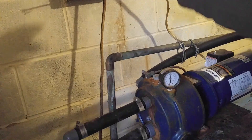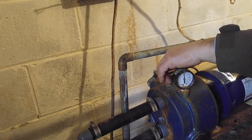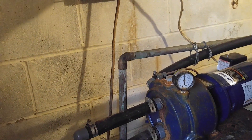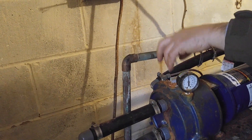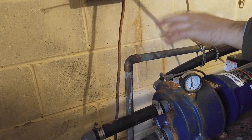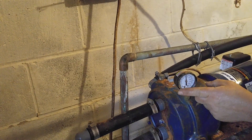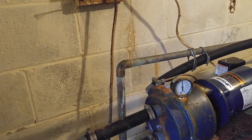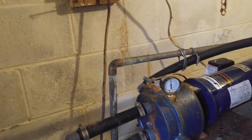You put that plug in about three or four rounds, just enough to turn it, then turn the power on. You'll see the air come out around it, and a little bit of water is gonna come out when it's trying to pump. When it takes off, the gauge will start raising and you just start cranking the plug off. It ain't hard — it'll change from a rattling sound to a smoother sound.